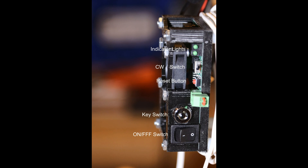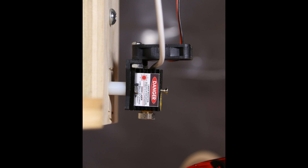This picture shows two things. First, you can see the nylon spacers I use to stand both the driver board and the laser off from the mount — that gives more room for air to circulate and makes everything a bit easier to get to, so it's not flush against the mount. I use those nylon spacers with number-six screws. You can also see the laser fan on top, which comes as an option — I think it's around $10 to $12, but it's certainly worth it to keep the laser cool and blow smoke away from the lens.